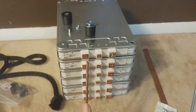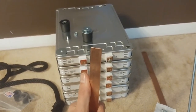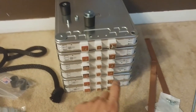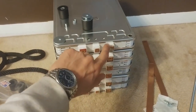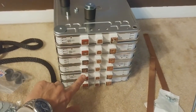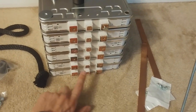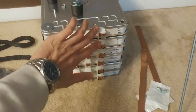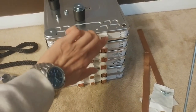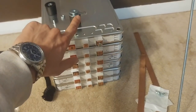It's a 0.15 inch thick by about 0.67 inch wide piece of copper — overkill, but a pretty good chunk. The way it's going to go: one bus bar here, another one connecting four right here, another one connecting four of these right here, and one connecting these two. Then I'll hook my inverter up from here to the inverter, and from here also to the inverter, and that will give me 24 volts.